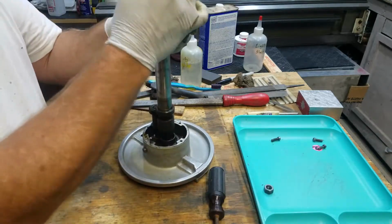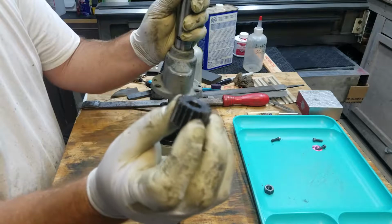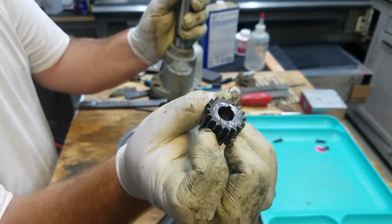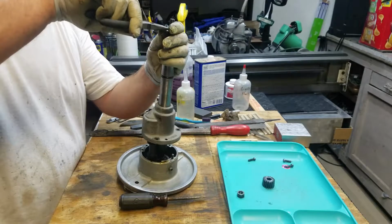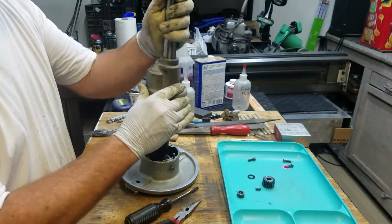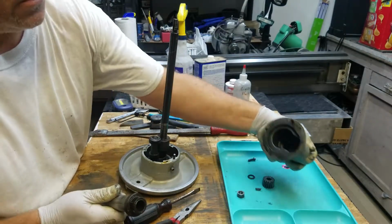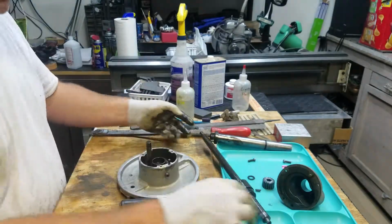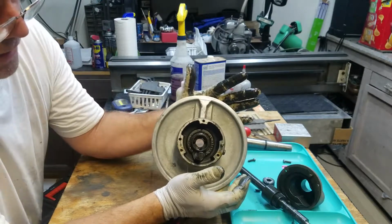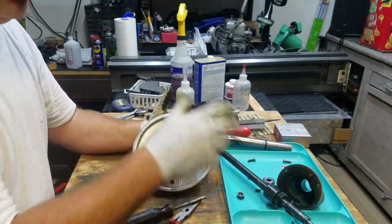Go ahead and remove this gear again. You can see the raised edges on that gear again, where it should be relatively flat, but the wear has just cupped it, almost like a bowl. This key lines up with one of those 4 square cuts and allows direct drive. And then when this is pulled out, it comes off of this and then should go through the reduction transmission.